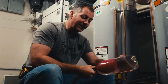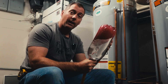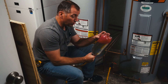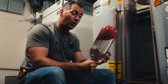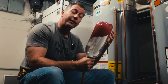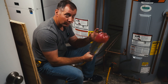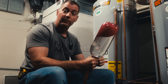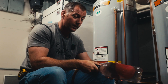This is exactly what goes on inside your thermal expansion tank. As the system increases its pressure and builds volume, it crushes the rubber bladder inside the expansion tank, and that allows the volume to move into the tank temporarily. When you open a faucet or use any water in your home, that bladder will immediately expand back to its normal size, and all of the water will immediately leave the expansion tank and rejoin the rest of the system.